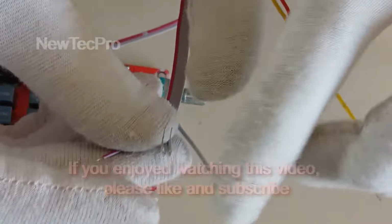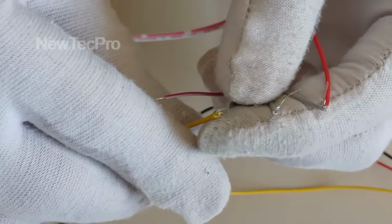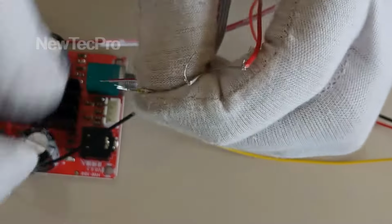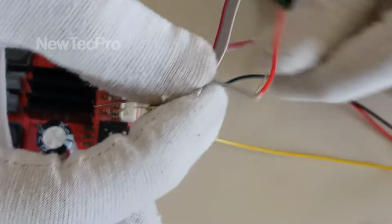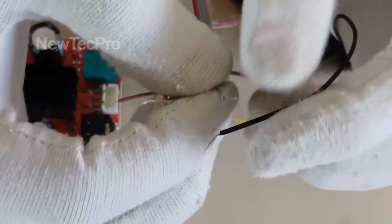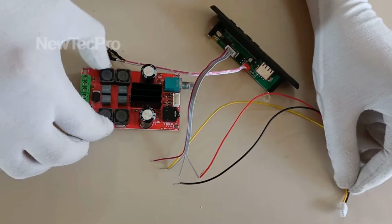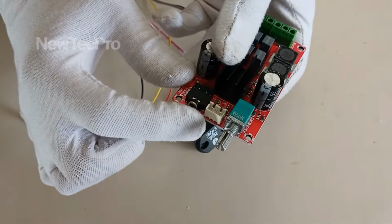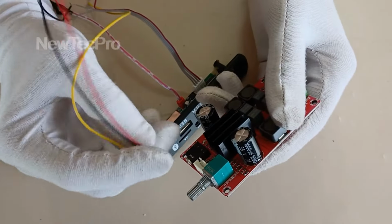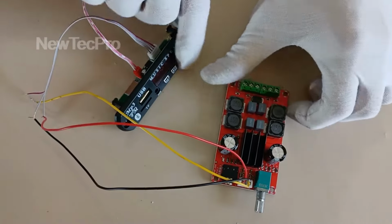Connect the right channel and connect the left channel to yellow wire, and finally connect this wire to a black wire connector here. That's good. Okay. We can use MP3 module player to input amplifier audio here. That is good. Okay,